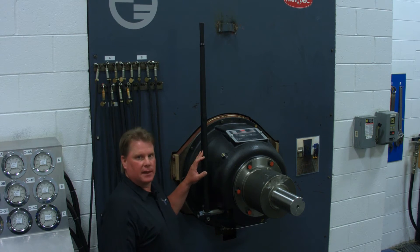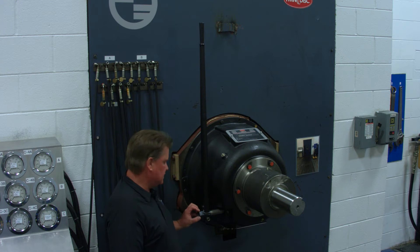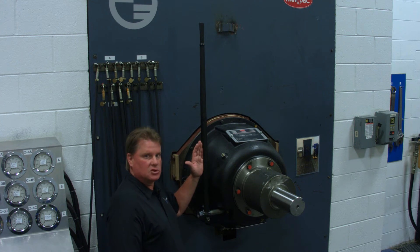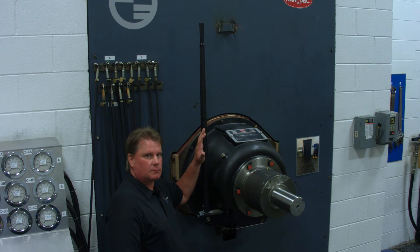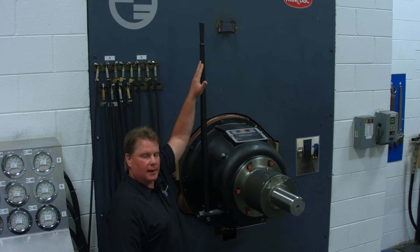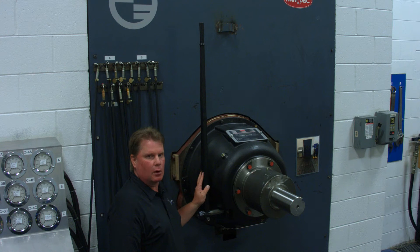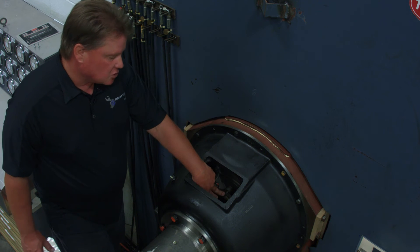Next, I'd like to discuss proper hand lever installation and location. The hand lever should be installed with the cast hex facing out — this allows a three-quarter inch drive socket and torque wrench to be used to check the engaging torque of the over-center clutch. We also want to install the hand lever as close to the 12 o'clock or 6 o'clock position as possible, with the clutch engaged. This helps prevent premature wear to the throw-out bearing and fork. Also, it's never a good idea to put a rubber bungee cord on the hand lever and load it forward or backward to prevent vibrating, as this too will lead to premature wear of the throw-out bearing and fork.